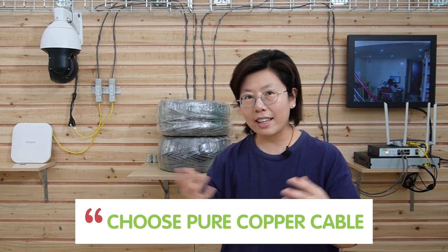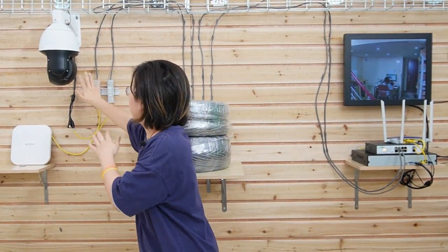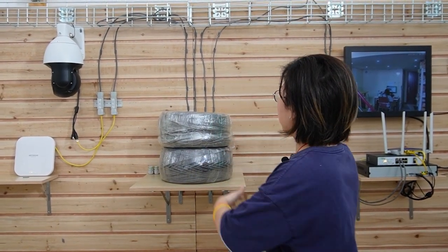There's no extra external power source needed at the edge. Here are a few more tips: if you're doing a PoE connection, make sure you choose a pure copper cable like Cat5e or Cat6, because copper has superior conductivity and provides stable power delivery. Also, be careful with your power budget — our long-range PoE switch has a total 120-watt power budget, so if all your edge devices add up to over 120 watts, some devices might not get enough power. Also, this PoE extender is IP67 waterproof, so you can place it outdoors near your edge device with just a short Ethernet cable in between.